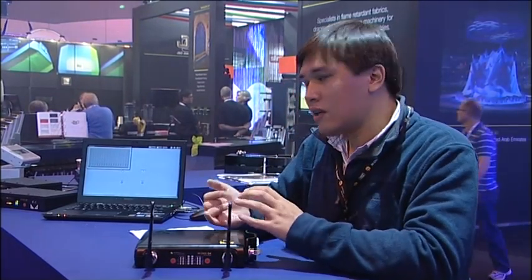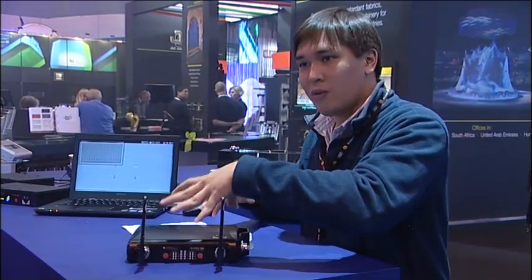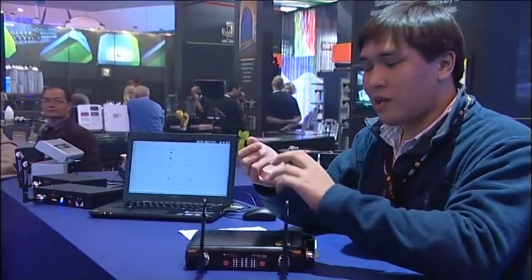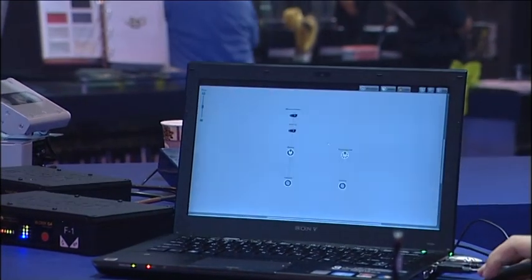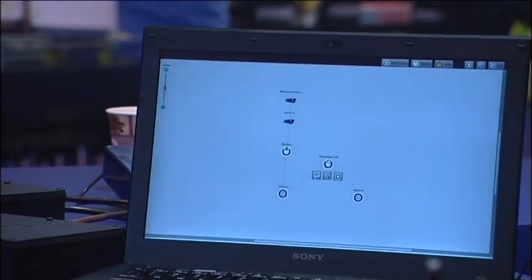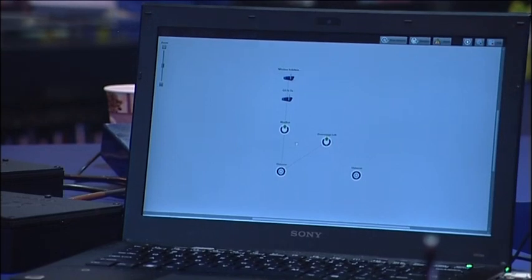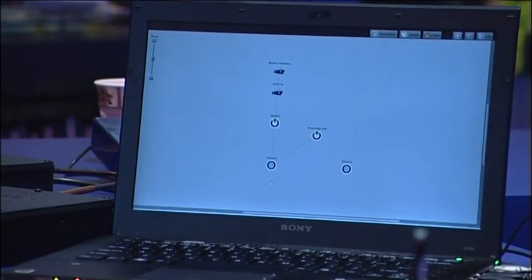The really key point is a consolidated view of everything going on in your system — Ethernet-to-DMX, wireless, and RDM — in one software working with our standalone and embedded systems. It's very easy to use. It's a simple drag-and-drop interface, and like I showed you, you don't even need to know what ArtNet universe you're using. You just set up a universe here and drag and drop the nodes. If you really want to define the universe number, you do have to go into the universe itself and set it, but you don't have to do it for every node — you just drag and drop once you've done the basic settings.